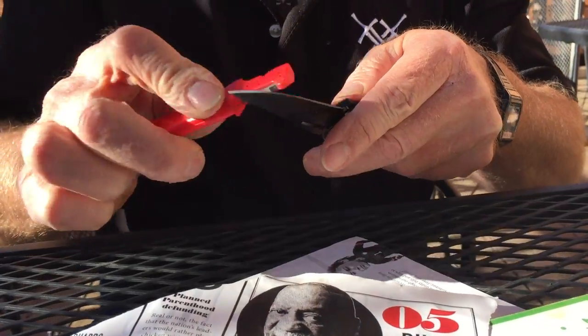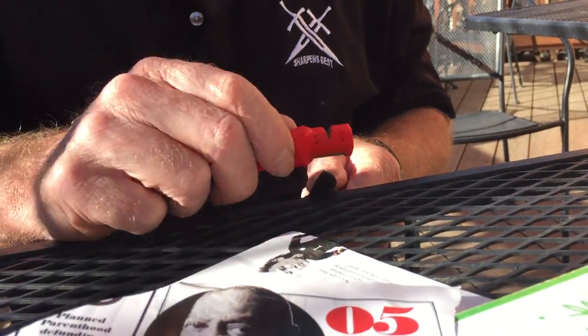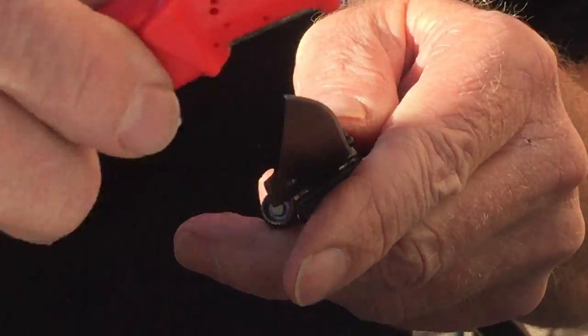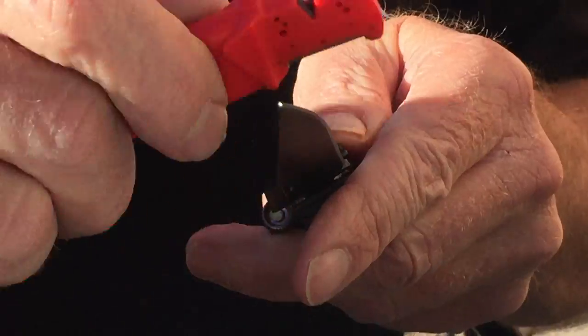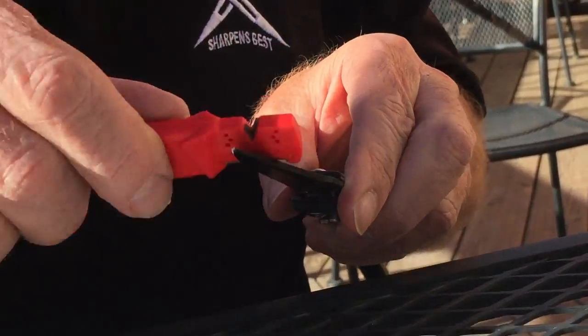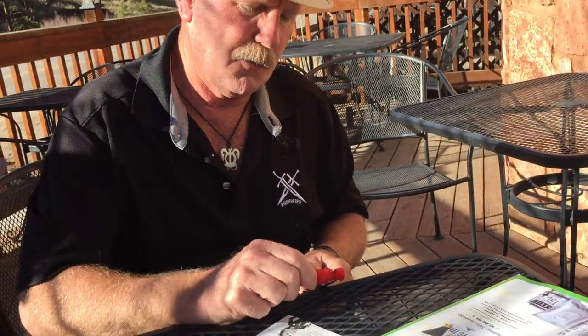I'm going to set it down and work on it like this. It's actually kind of thick, so you'd have to flatten the bevel out a little bit on this knife to really make it a slicer. If you want to keep it more of a work knife, maybe you want to leave it the way it is — a little bit thicker blade, tougher blade, not as sharp. If I sat around for maybe five or six minutes with it tipped down more, like an 8 to 10 degree bevel, I would actually cut the side of that knife down and it really wouldn't take very long.